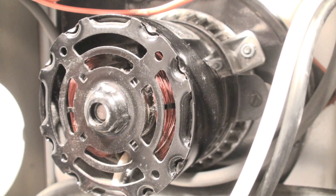The bearings just dry out. You can get oil into them and get them running again if they've seized up, but it's not a permanent repair — just temporary. You'll have to replace the inducer. By the way, do not replace just the motor on the inducer; replace the entire inducer. You'll never get it balanced right.